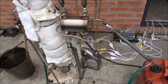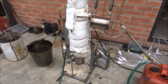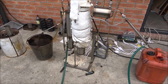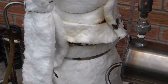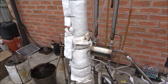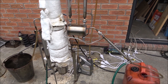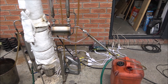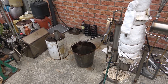The machine is okay now. It was smoking a little bit at the beginning because of the new gaskets. There's still a little bit of smoke from the gaskets — possibly seeping slightly — but it's not a problem. At 410 degrees I'm getting very thick oil. I possibly need to decrease the supply flow and increase the temperature to improve the output.